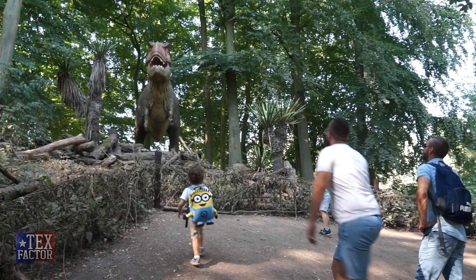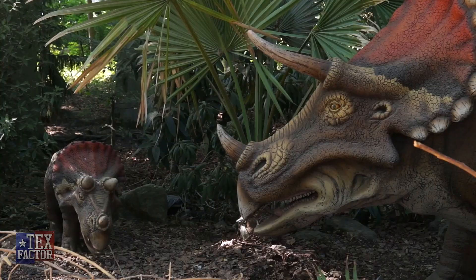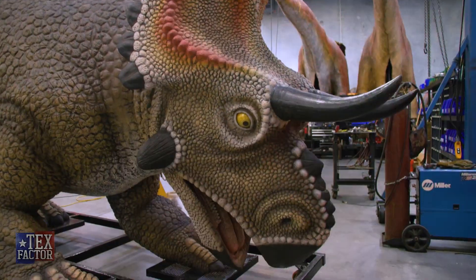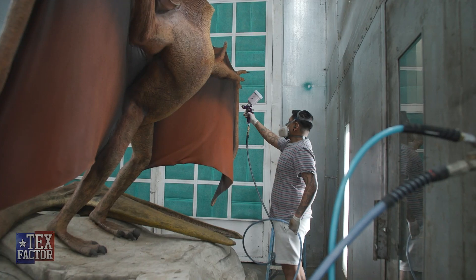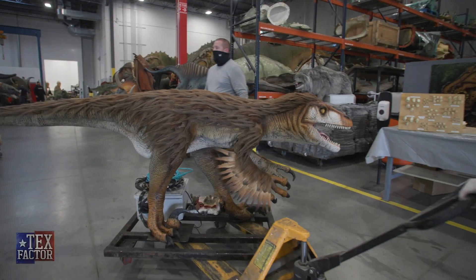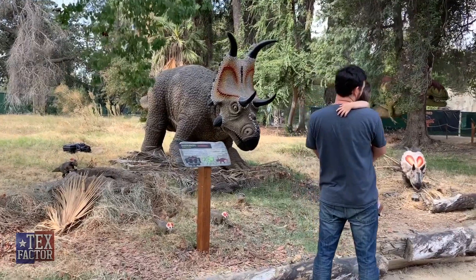My name is Tommy Ferrari. I am a field service technician here at Billings Productions. My main job is to go out on location and service the dinosaurs every four to six weeks. They are out in the elements and they move around, so they require a fair bit of maintenance. When I'm not out on location, I help out in the warehouse — whether it be paint department, electronics, skin department, any of it. A typical repair would be somewhere that the dinosaur moves around a lot, like the neck or the arms. The paint will start to peel off or wear down, or the rubber skin will start to tear a little bit, and we want to assess that before it snowballs into a larger problem. The kids always ask if it's real or not — they're not sure — which leads us to believe that we're doing a good job.